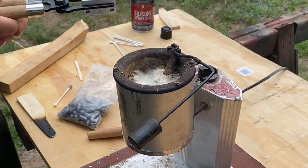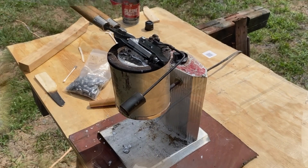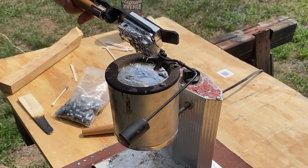In order to get successful castings, you're going to need to heat your mold up first. Just lay it on top of your lead pot and let it warm up. Go ahead and dip your mold into the lead and when you pick it out, if the lead is still stuck to the mold like this, the mold isn't hot enough yet.